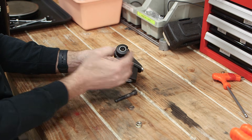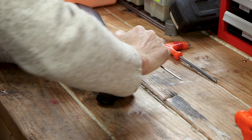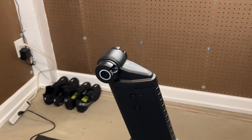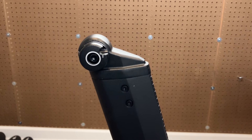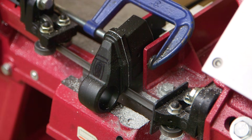Here's what I did to add adjustable setback to the Zwift bike seatpost. I pulled the seatpost apart and pulled the top off. This is just one big piece of cast aluminum, which is great, so there's lots of opportunity for machining. I put it in the bandsaw and I cut it apart into two halves.